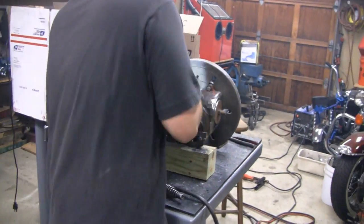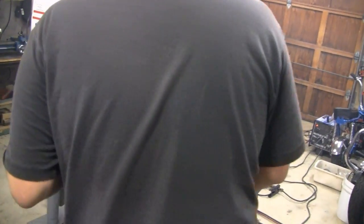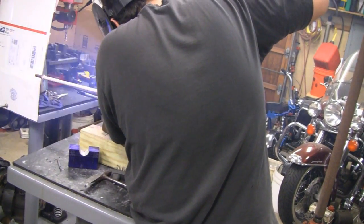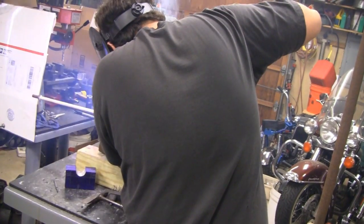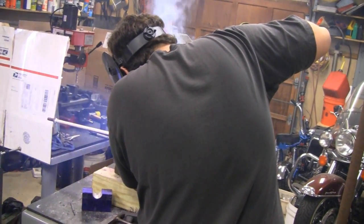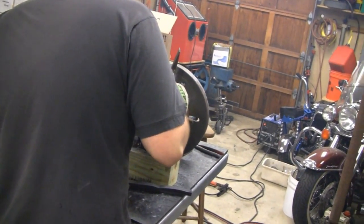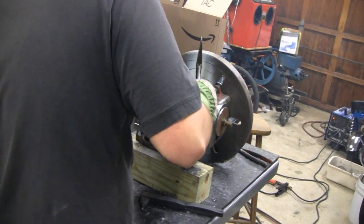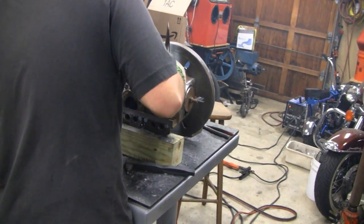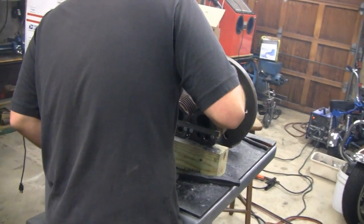Mike's killing it. We got the first two blocks done, now we're working on the other two blocks. I don't know if we're going to be able to nail them together tonight, but we're making progress. Watch your eyes Tubes. There he goes, steady as she goes. I guess we'll show you the other blocks. What's your procedure then Mike — just doing it one inch at a time? Yeah, that inch at a time. If he does it one inch at a time, that means you alternate it from one side of the block to the other, and he keeps peening it. Then he doesn't have to preheat it. It worked good for the other block — if the other block didn't crack.